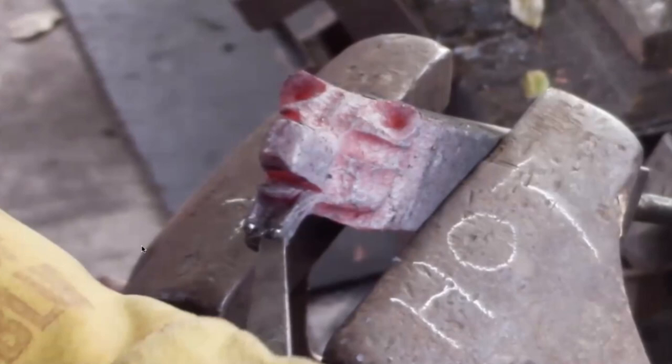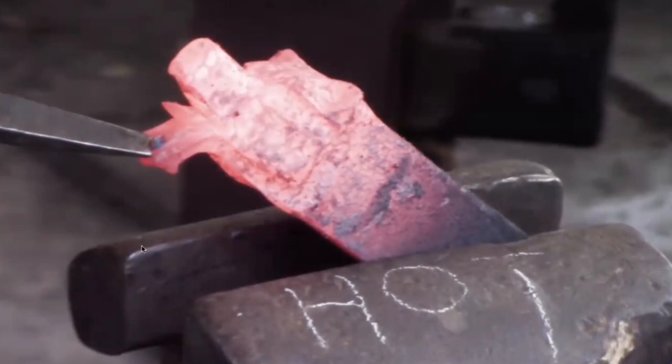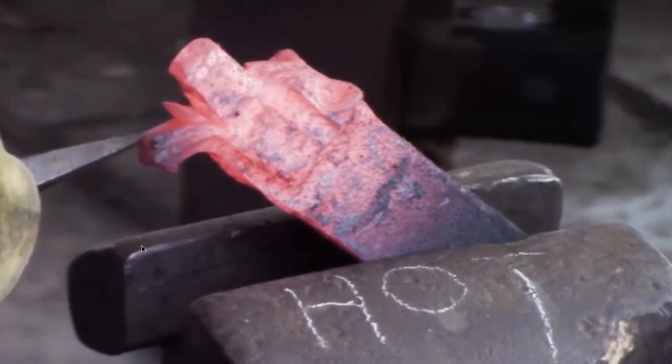I don't mind that the jaw is open. We'll close that with our 5/16 fuller later on. You can see I'm just rocking the material around. It's another look at the same move. Nice light, rapid blows, rocking the fuller backwards and forwards.